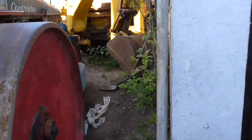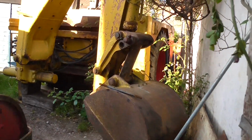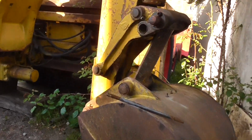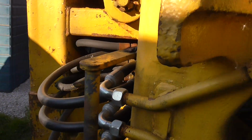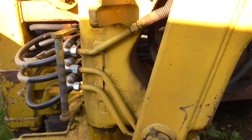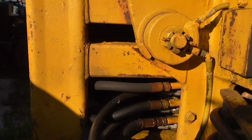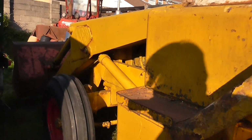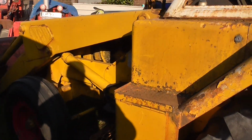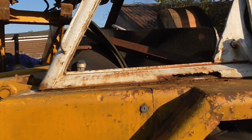Once all they're done, I'm on to the JCB 2D Mark II. It's the same age as the roller, actually. I've done the pipes on it, and I'm going to do the clutch on it. You don't have to split the tractor for the clutch on these. I'm going to do the clutch, and then I'm going to run up the other machines in sometime.